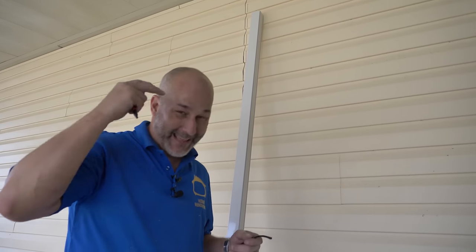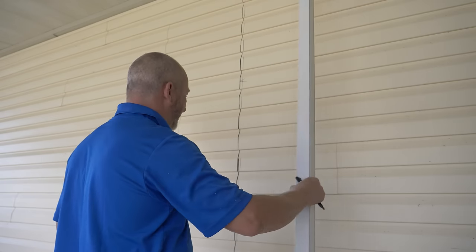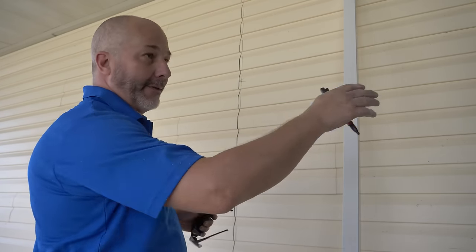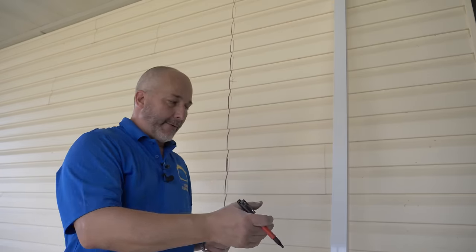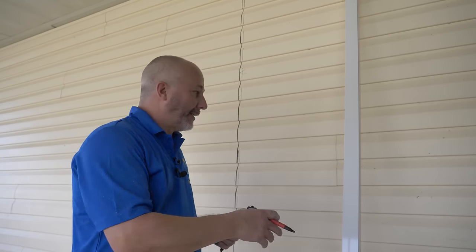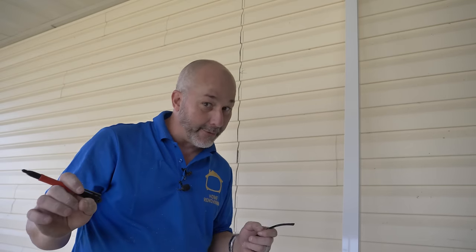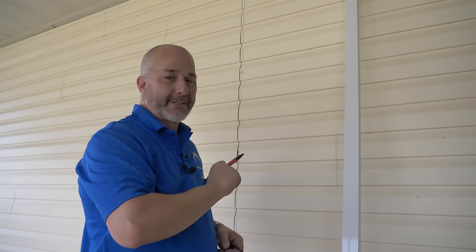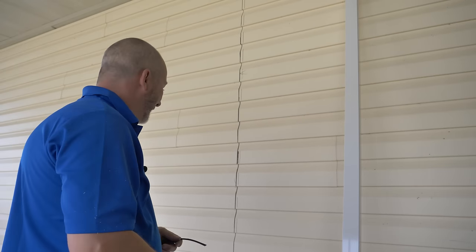That was interesting. Now, if you're a fan of the channel, you know you always think end from the beginning. You need to have the plan to finish. It's one thing to cut the wall open, but look, this siding goes to where the old wall was, and then it turns back into the old original facade from the 70s. I have a J trim there that's going to be exposed. But instead of taking all of this off and redoing all the siding to make it perfect, because it's just a Florida room, we're going to add another J trim and extend that siding, finishing the rest of that room off so it looks very intentional. Because right now, it looks like a patchwork quilt. I'm not a big fan.